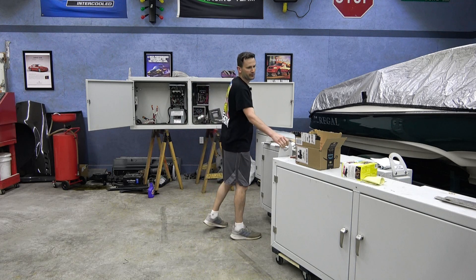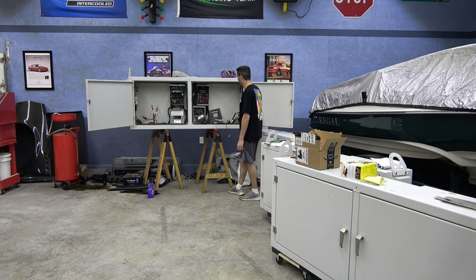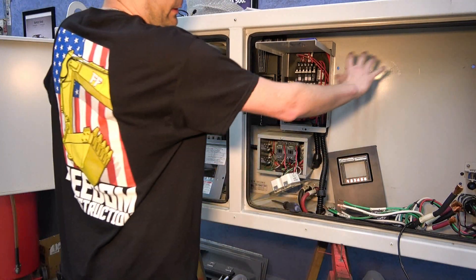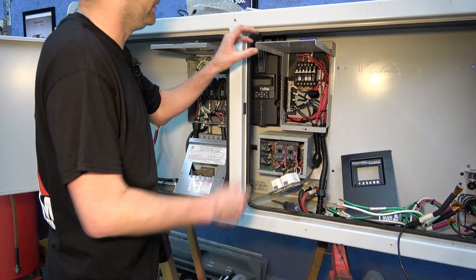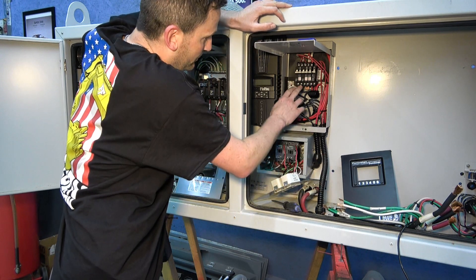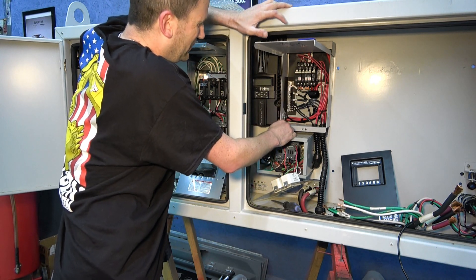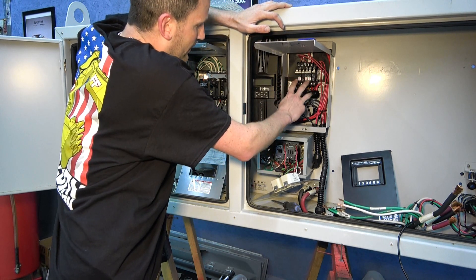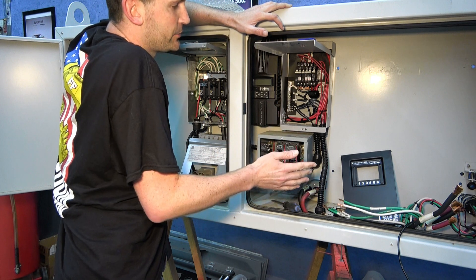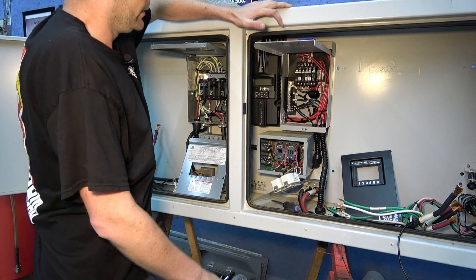I put all of them here — these guys are on wheels and they're really heavy, mainly because of the inverters, as each inverter is 150 pounds. Taking a closer look at one mid-disassembly: with the inverters out, what we're basically left with is the PV panel, which handles all the line voltage coming off the solar panels and protects them with a breaker and an arc-fault protection breaker. Then it's distributed into the Midnight solar charge controller. The inverters handle the generator backup side of charging and let the Midnight handle the solar charging side.